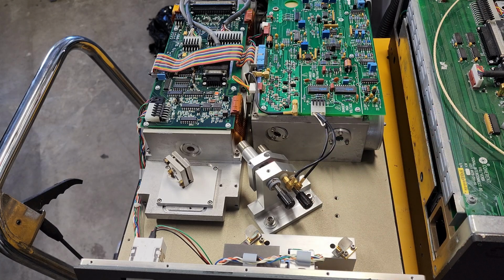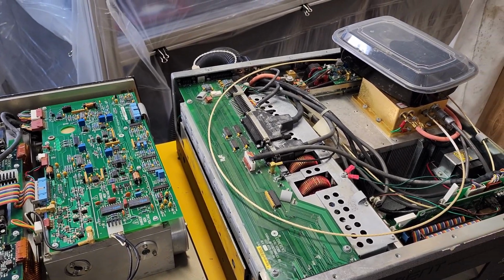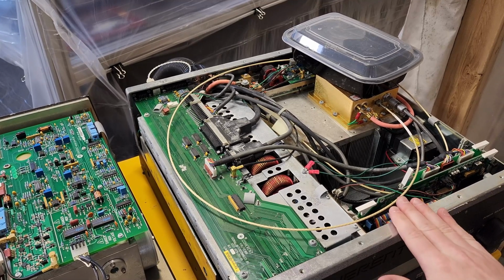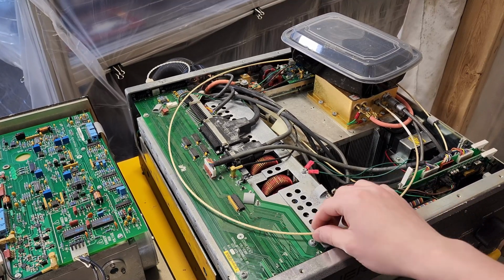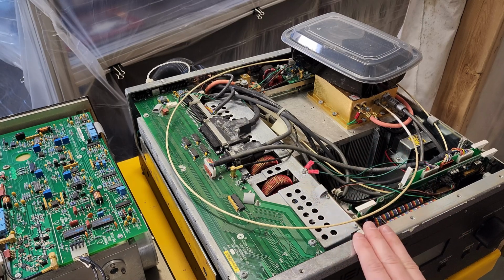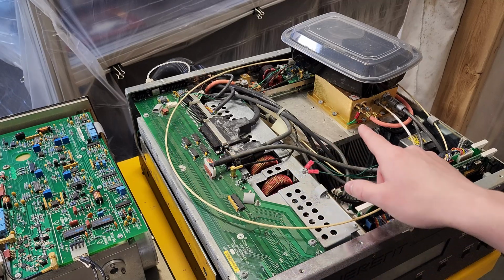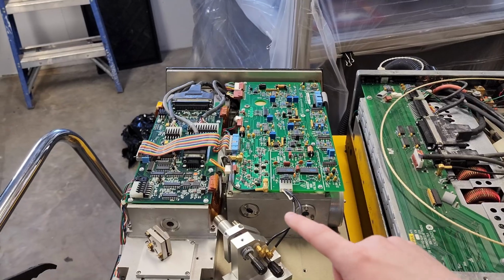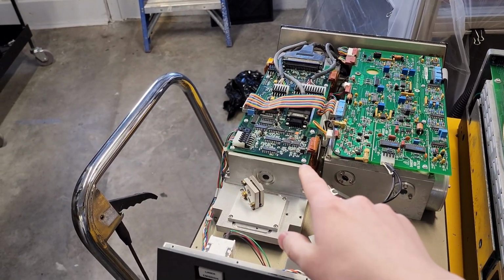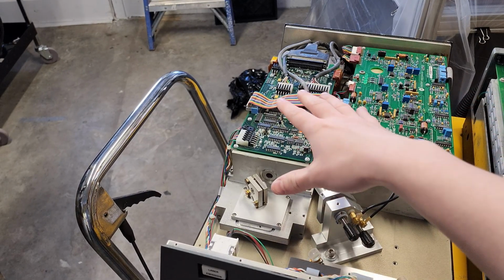So I guess really the first thing to do is to confirm over here that the power output from the diode module and the spectrum from the diode module is correct, assuming this thing turns on. If that's fine and there's no issue with the diodes, then we turn to the green laser over here. Once we get the power supply checked out and everything's good, we're getting light into the green box, okay?